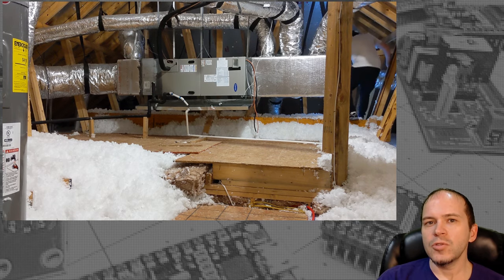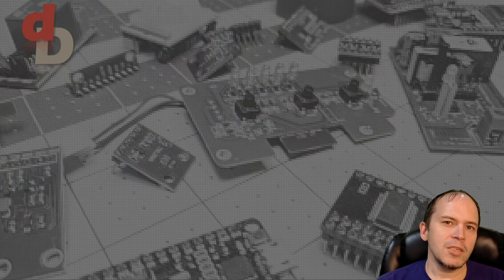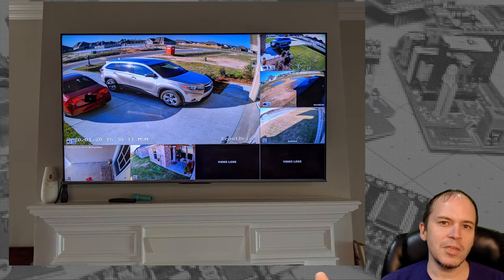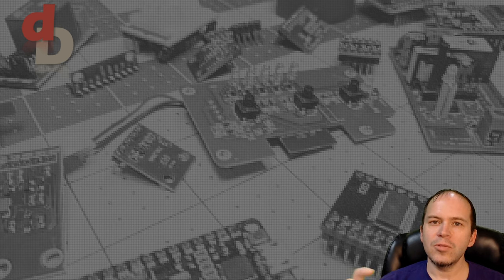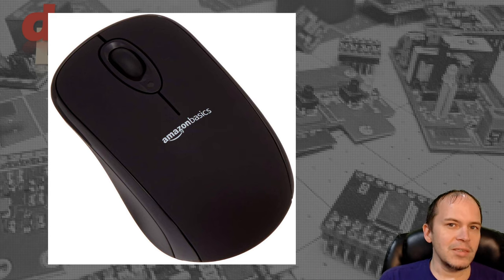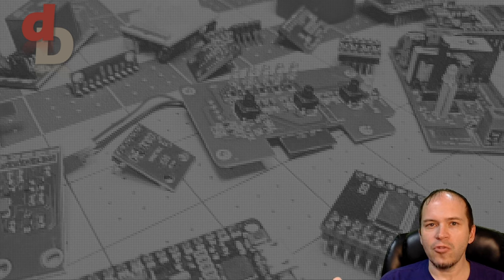Sometimes you can't run a wire directly from a camera to the NVR, in which case you can use a Wi-Fi camera that also connects to the NVR. In our installation we put the NVR in a wiring closet and ran an HDMI cable to the living room TV so the user could just change inputs and pull up all cameras. The only issue was mouse compatibility — Logitech mice didn't work, but a simple Amazon Basics wireless mouse worked perfectly through a couple of walls.